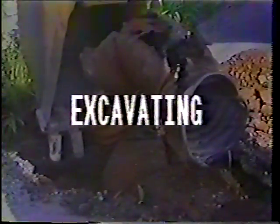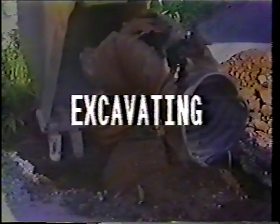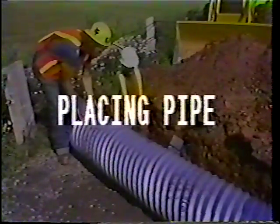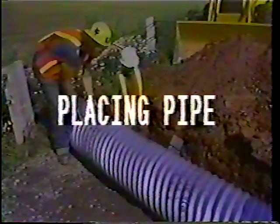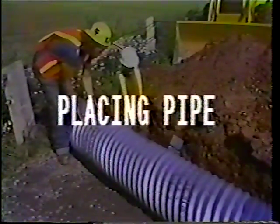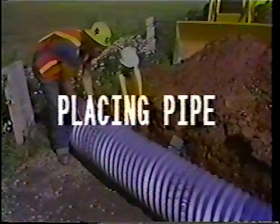Excavating for pipe installation involves something very similar to our pothole activity, in that we ask for squared sides, a bed or base that is smooth and dry. Placing pipe is, as we will see, a combination of gentleness and intelligence. The pipe is put in gently so as not to crack it, and it is put in intelligently so that the water will enter at one end and flow out the other, which of course was the whole idea of this exercise.